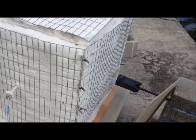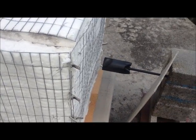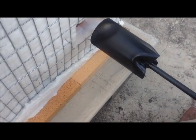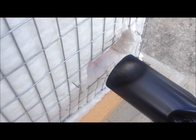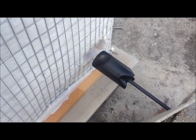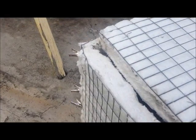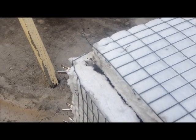We're up to about 1,125 degrees now. You can see I've backed the burner off a little further and kicked it into gear a little bit — got a little blue flame going in there now. Still got plenty of throttle left. I haven't changed the flue setting. I don't see any flames licking out yet, so it doesn't need more air. Still firing hopefully at a balance between oxidation and reduction.